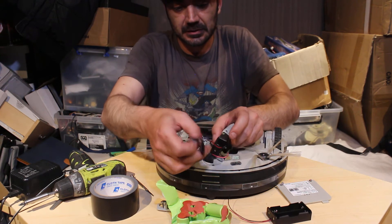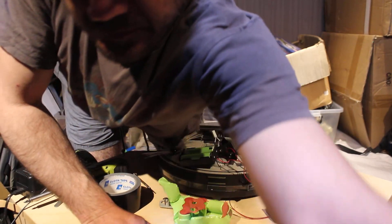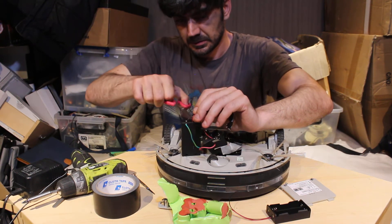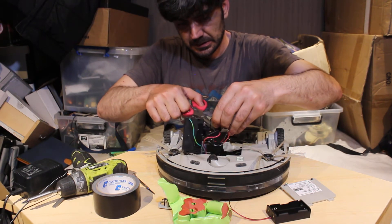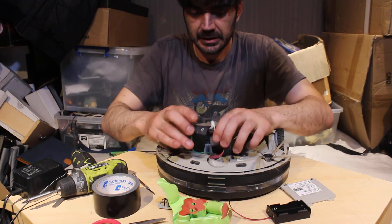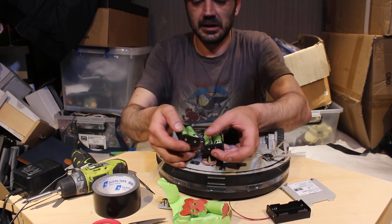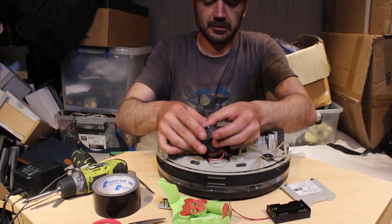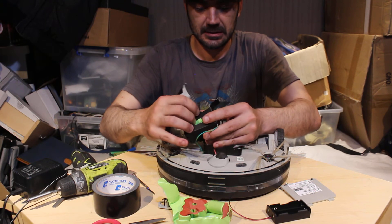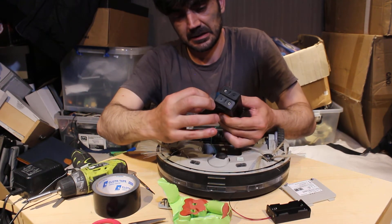And that's that fusible link I told you about. I'll cut these extra wires off now because I don't need them — one at a time, because they are connected. So all you have is your four batteries, and then you link up the negative and positive from these two with the fuse that's within the pack. I put it in there so I can close it up like this — and technically it's kind of the same as what it was in the original pack, hiding amongst the batteries to get that thermal contact it needs.